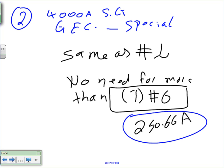I want to remind you guys, that went to the water pipe and the rod. If I have a steel or if I have rebar, that doesn't apply to it. There's also an exception there for a ground ring. I can't remember, the ground ring is number two, I think, for a ground ring. Any question, guys, about number two? So number two is just a special grounding electrode conductor that's going to the ground ring, going to the pipe. Any comments, any questions about number two?